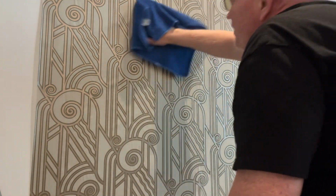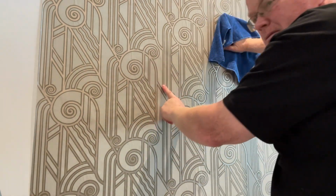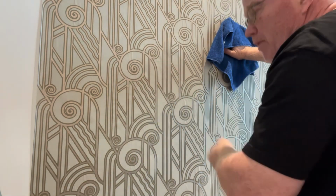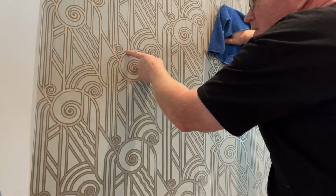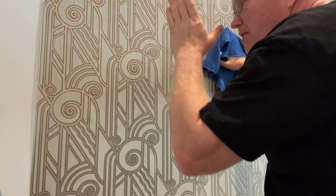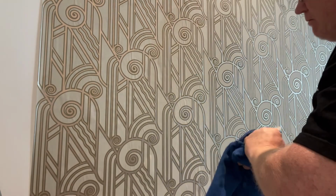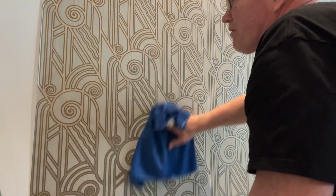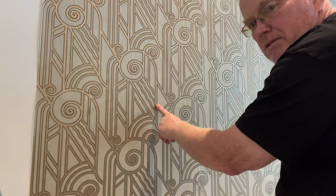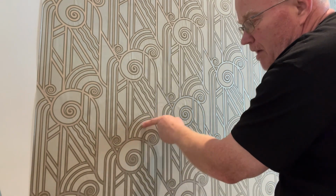Now, as I explain this to you, understand that this ink that makes this pattern is a different material than this color here. When I wet this with paste, you can see that the pattern on the other side of it remains hard and straight, while the rest of it crinkles up. So what does that mean? It means that the wall covering is expanding at a greater speed in the solid areas than these ribbed painted areas.